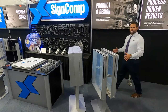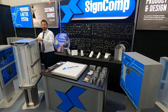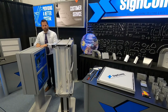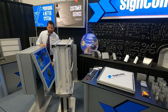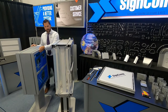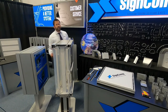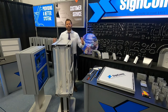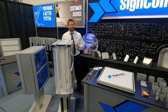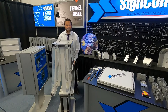Now we're moving into the commercial line. There are a few things I really want to touch on, starting with our main cabinets. In the standard product line and EconoComp, the faces slide out for service. In the commercial product line, we're dealing with hinge face solutions. We do have retainers for rigid faces — a two and a quarter inch and an inch and a half — and we just undo a few screws and these swing open. The difference in retainers comes from your specifications, like depth and how big the cabinet is, to distinguish which retainer to go with.